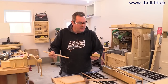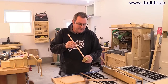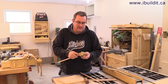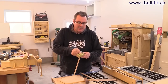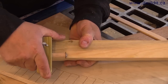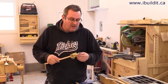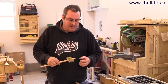So basically now it's finished. All I need to do is take the dowel with the cutter on the end and slip it into the hole. It should slide freely in there without the nut tightened. Set it to the depth I want to mark and then tighten the wing nut — it's ready to mark. The beauty of it is if the wheel does get dull, you can always take it off and sharpen it in the same way you sharpened it before.